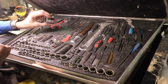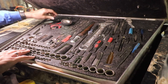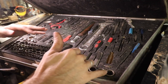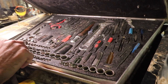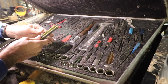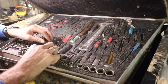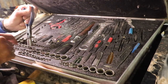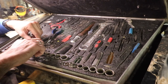I have a pick. Any oddball tools like this 28 millimeter half-inch socket — I think that's for the pinion nut. I have adapters, electrical tape, and plumber's tape. I've also got a little tray that I built — if I'm working on something and I know I'll need that tool again, I can just put them right there, or if I'm in a hurry I'll stick them in the tray until I finish the job. One tip: I cut the big tool cutouts with a long-handled razor. For round sockets, you hold them with pliers, heat them with a torch, and dip them into the foam to make the socket cutout. Use a smaller socket for the next bigger hole so they still fit tight when you're done.